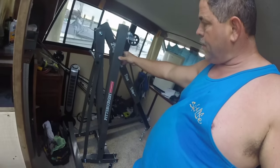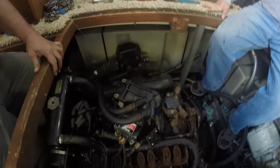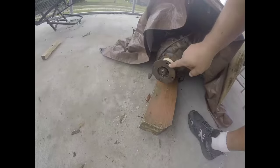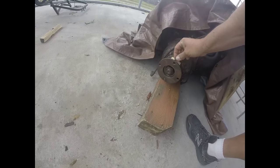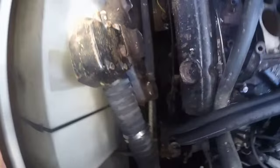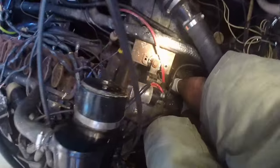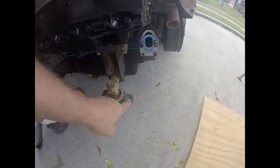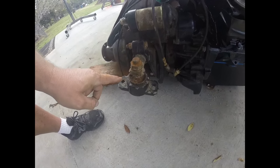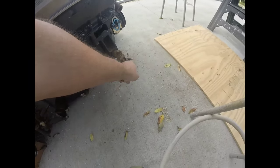Here's a video of it down inside. What I'm going to do is disconnect the transmission from the prop shaft. It has four bolts and nuts — I'll light it up so you can see it down there. The bolts go through the holes and the nuts are on the back side; you take it loose and it'll come free. Here are the engine mounts — there are four of them, and each mount has two bolts and nuts. You just take the nuts off the bottom side, the bolt goes through the holes, and it releases. Eight nuts and bolts total is what's holding that engine in there.